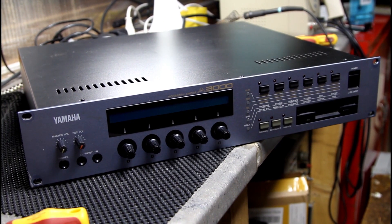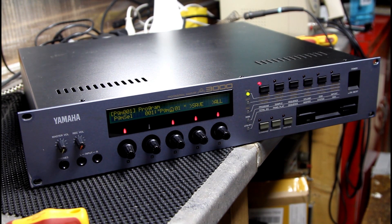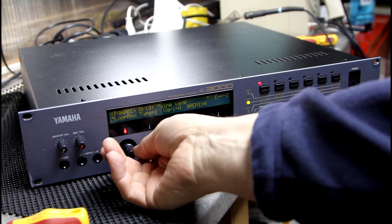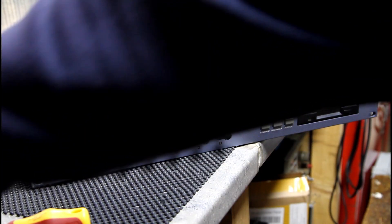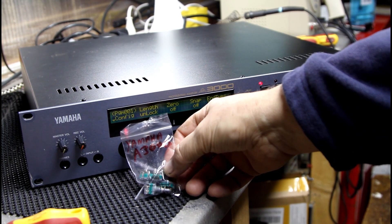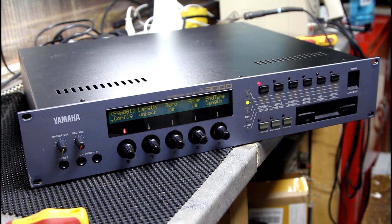The M3 x 8 screws are great — we've now got a full complement so nothing is loose anymore. Switching it on — this unit has version 2 of the software installed, which is an upgrade over the original version 1. All the new Alps encoders are in, as close to the originals as possible. Keeping the old originals labelled up 'Yamaha A3000' because if you're careful you can disassemble them and clean them with isopropanol, so they could serve as spares.